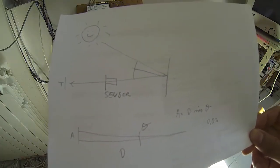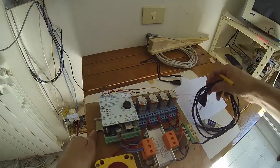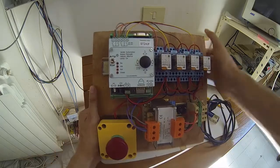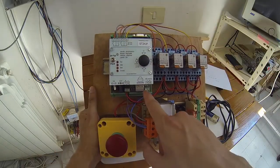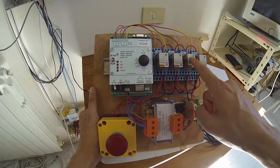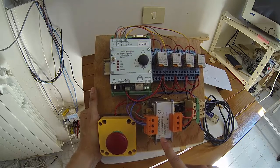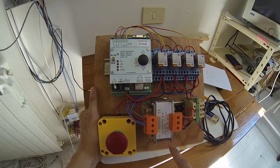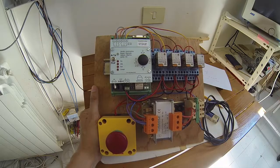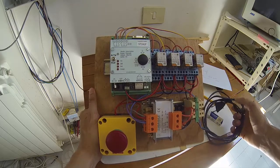Let's stop the theory and get into it. This is the control system I've set up: a control board I made, connected to the sun direction sensor and four relays that control the motors — up, down, east, west. I also have a transformer to make 12 volts DC for the motors, rated at 5 amperes, and the relays are 10 ampere capable.